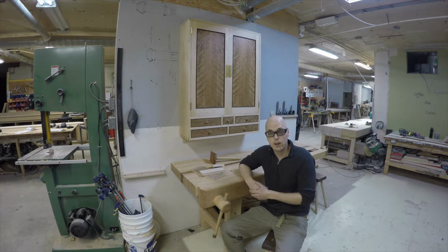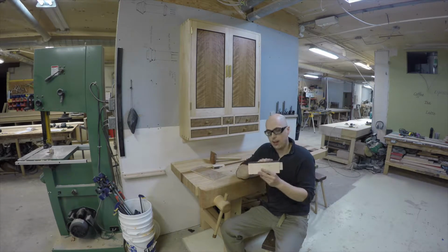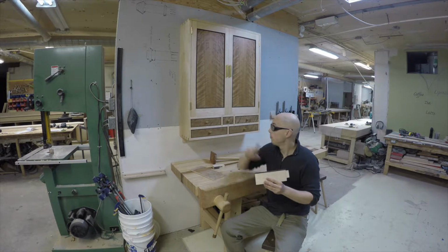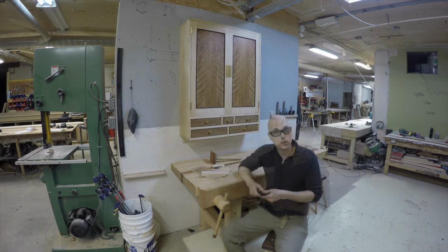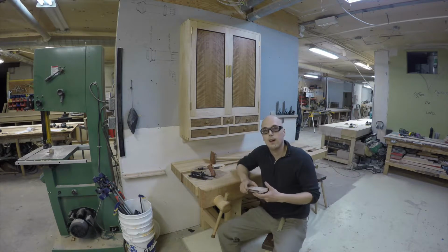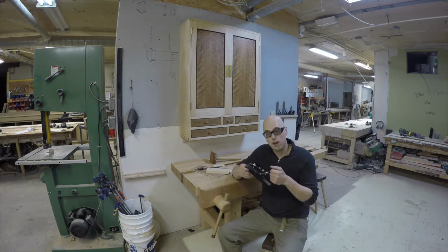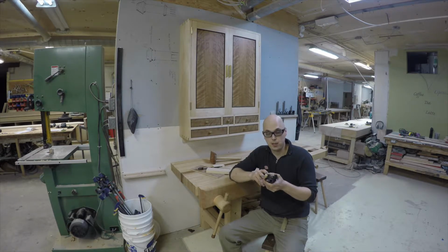As everything started the same way, I milled my stock to dimension, with the exception that when I prepped my stock, I glued a strip of 1/4 inch Wenge, which is going to become my beading molding inside. When that was done, I used my scratch stock to scratch the bead on my pieces. After I did my scratch stock, I plowed my groove for my panel. For that, I used my small plow plane from Veritas. It's been on my wish list for 3 years, and I've been through 2 major modifications, but I'm really happy I bought this one. I'm still learning to use it properly, but I really enjoy the way it works.